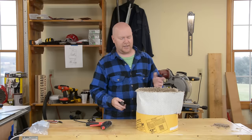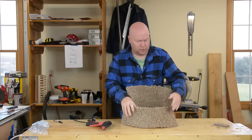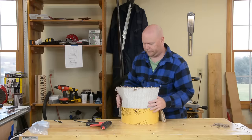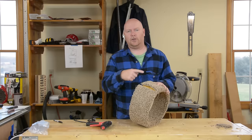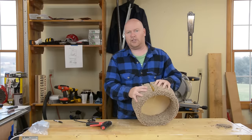There's one other thing you're going to have to do before you can fold that over, and that's make a relief cut here opposite where this seam is. It would be really nice if the carpet was cooperative enough to fold itself over here but it's just too stiff. I guess you could muscle it if you had a lot of patience but I don't. It's still going to require a little finagling and a little muscle, but now you should be able to fold this carpet over.